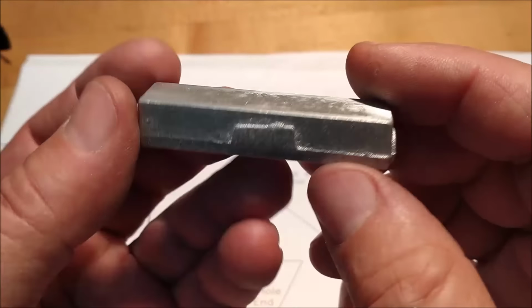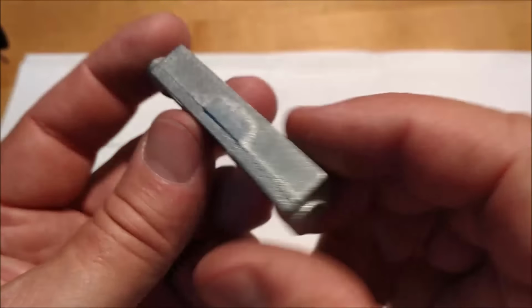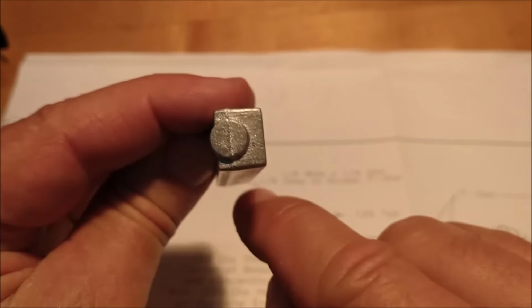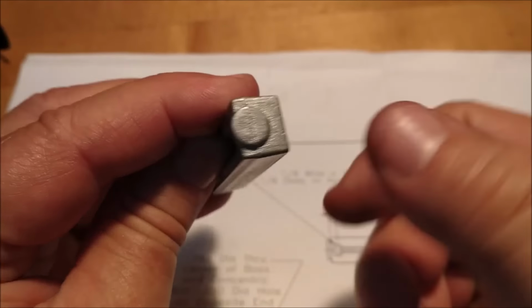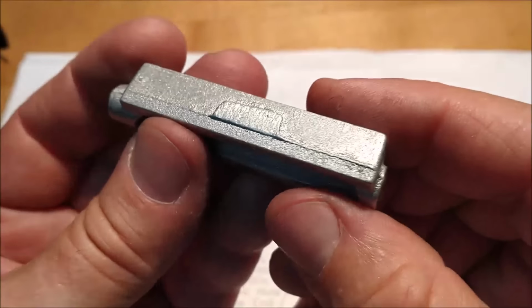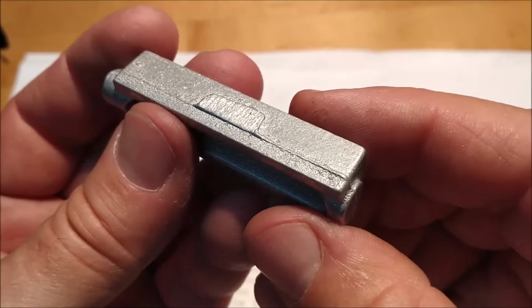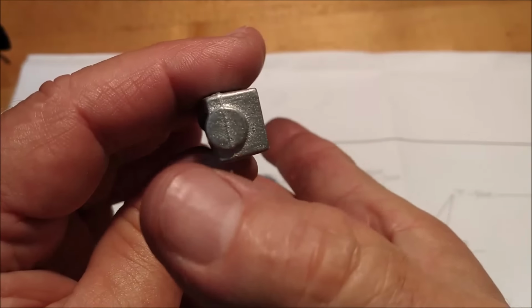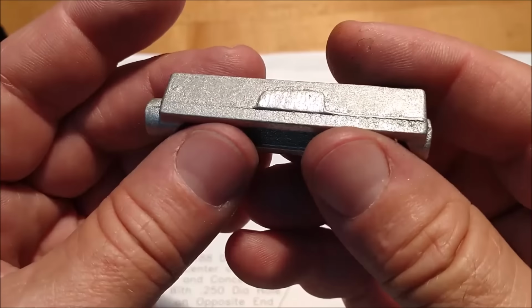So for the first couple of cuts, I'm going to hold it real gently. I'm going to put it in the vise stationary jaw. It's going to be registered here on a pin because this is a draft surface. Anytime you use a pin and a draft surface, make sure that the draft is downward towards you. That will force the pin back against the stationary jaw.